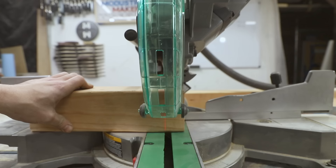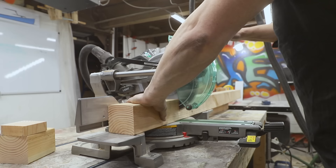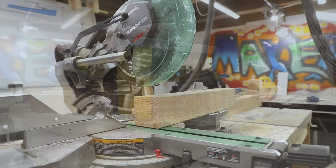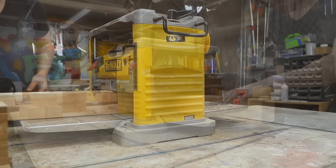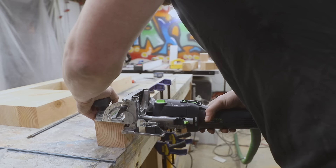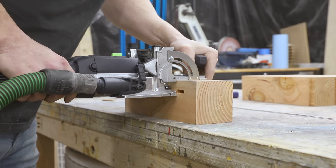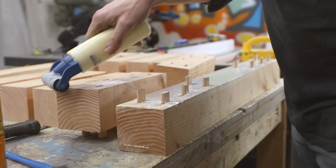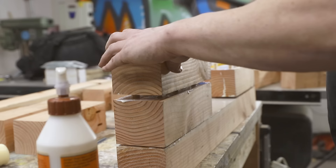Now let's get back to my old workshop and make the wood countertop. I'm going for a modern industrial style in this bathroom, so I ran the 4x4s through my planer to get clean surfaces and sharp corners. After planing and cutting the 4x4s to length, it was time for the glue-up. I used dominoes to help with alignment during the glue-up, but this step is optional — you could also use biscuits or dowels, or with lumber this thick you don't really need reinforcement at all and could go with glue only.